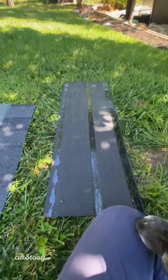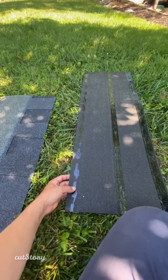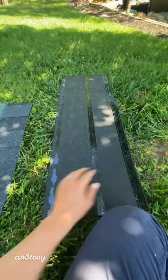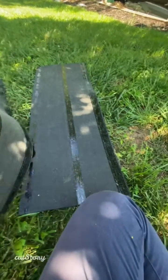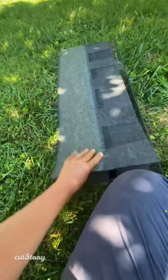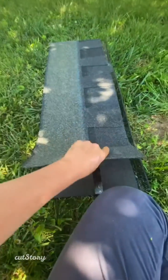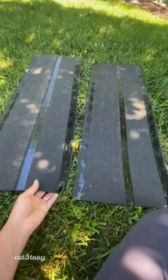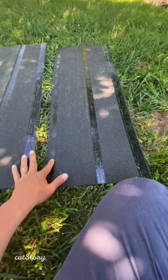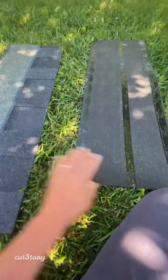This is actually the back side of a shingle. What you'll see here is the adhesive strip, and then you have a plastic wrapper on the back side. The reason for that is when they come packaged, they're back to back, so that plastic strip allows the adhesive to release, especially on a hot day like today. This is the adhesive strip that actually seals the shingle to the one above it.